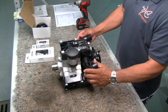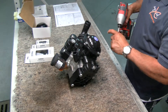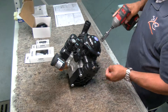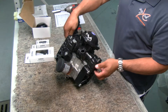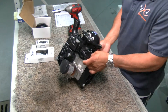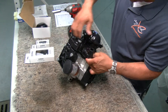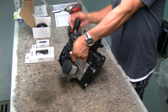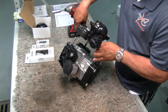The first thing you want to do — there's oil in the system so we can change it with oil in there. We're going to take off these three bolts or nuts here. It's the same with all the other pumps, same type of setup, just more diaphragms. We're going to take off this chamber. Sometimes it's a little hard to pull apart, sometimes it's not, but you just want to work it so that it comes out evenly. You don't want to stick a screwdriver in and jar the edges, so just work it off gently. It'll come out slowly — there's no oil that's going to come out there.